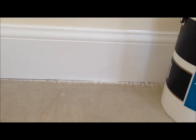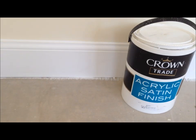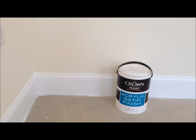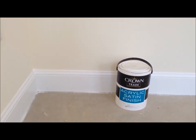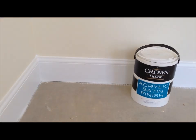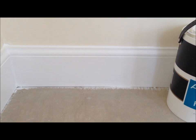So that's actually been finished in this satin now, and you've got a water stain which is quite visible through the finished coat of the paint. The only way to get round that is to undercoat it, then put a stain block on top of the undercoat, and then finish it off with the acrylic finish. That's basically what you get using a water-based system — it can be a bit of a problem.